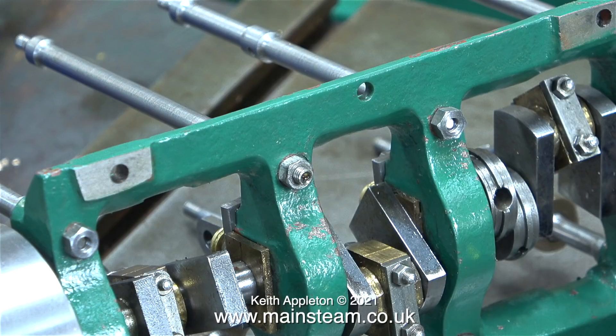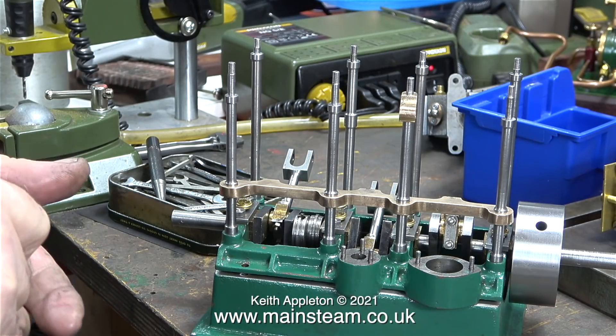There are three mounting holes on this side: two of them go through casting pads but the center does not have any reinforcement, so I'm going to create some by tightening the sole plate down onto the box bed. If I put too much pressure on the bolt in the center it could crack the sole plate. I'll show in a future episode what I'm going to do about it.